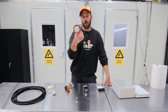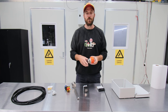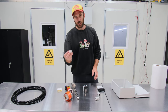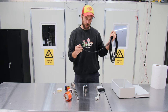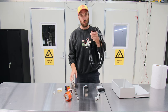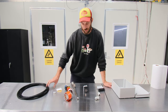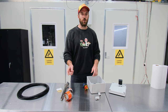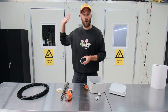A few other things: we've got a heavy-duty power plug because when you're running 20 amps you need a larger plug - the usual rating at the wall is 10 amps with a small plug, but because the draw is so high we need one of these. We've also got a couple of cable glands, some connectors, chocolate block, and some thick cable. The cable needs to be thick to handle 20 amps - this is 4mm squared cable, 250 to 440 volt, from the electrical supply store. If you're not qualified to connect electrical equipment like this, don't do it - always get a qualified person. We also need a thermocouple - it's a big probe that takes the temperature and sends the reading to the PID so it knows how hot the substrate is.